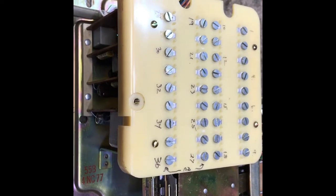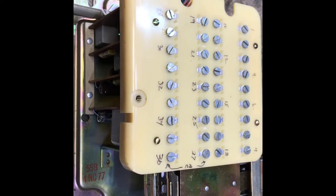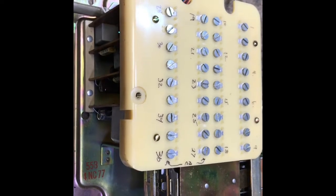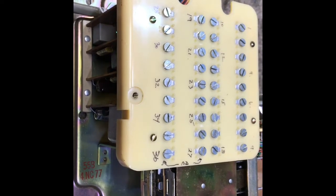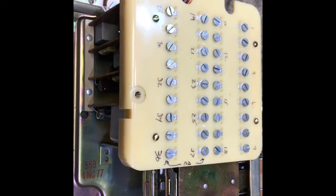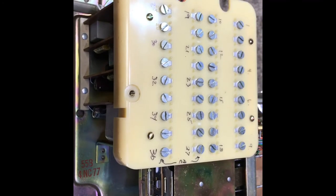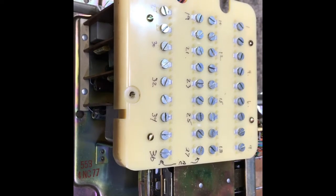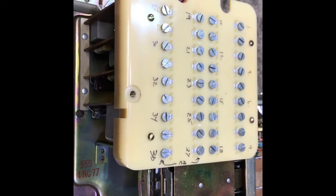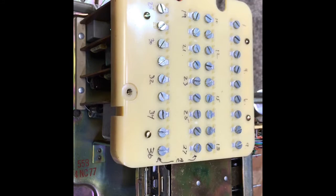The particular key phone that I have this unit connected to is a five-fingered cable, so there are 20 pairs in each of the fingers. So I can wire the cable to the screws according to the color code that shows on the chart without making a custom cable with only the few leads I need.